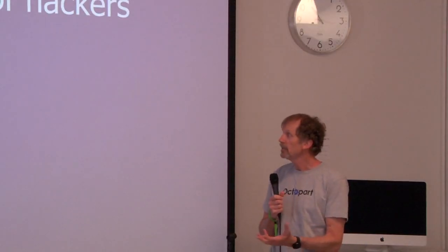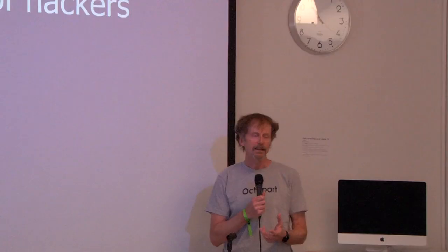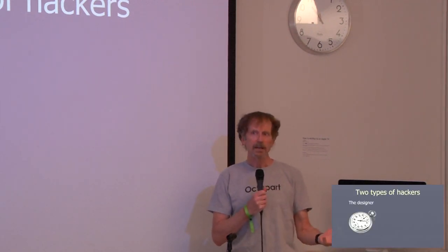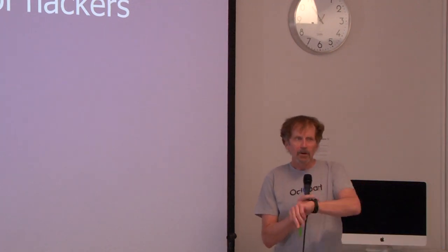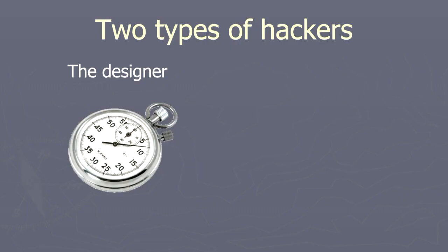So as the designer, your primary concern, I think, is getting your board working. And after you've done a few boards, you'll realize your first version is probably not going to be fully functional. So my recommendation is don't go for the tiny little fit-in-the-wearable board on your first try. Go ahead and make it a little bit bigger, put some hooks in there for debugging, which I'll go over, and save yourself some time instead of trying to tack blue wires on surface mount parts. We're going to avoid all that and just make it more efficient.